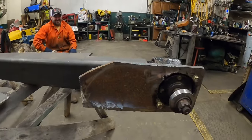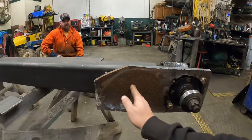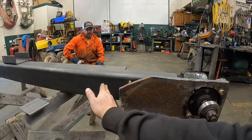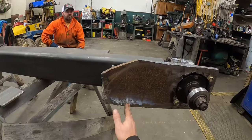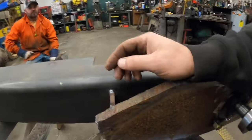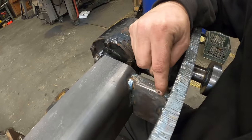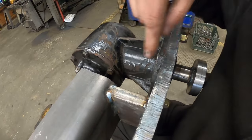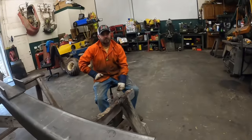One thing I noticed that we both really didn't like whenever we had this on here is this plate stuck out past the blade. So I think we can trim this plate off right here where the blade's at. That'll also allow us to eliminate this smaller bracket and we can put another bigger bracket in. And at that point, this bracket is gonna be as strong as this. So I think we can keep this clean without a whole lot of gusseting. Yes,